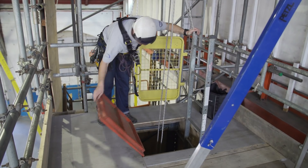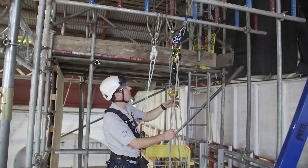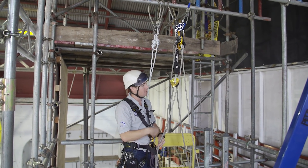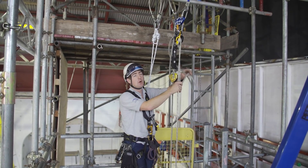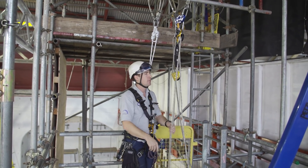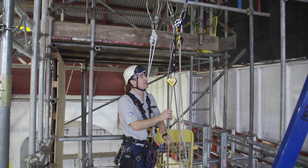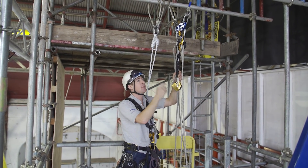Make sure you're clipped on while you do that. I've got an ID and ASAP, and we're sending technicians in so they can abseil down - in theory if anything goes wrong we can put a haul system on to pull them out. The big problem with this is that if anything happens to this line, we're now locked on and it's not a rig-for-rescue system. If you're doing any kind of entry-based work you want to be on two descenders so that both systems can be turned into a haul system.